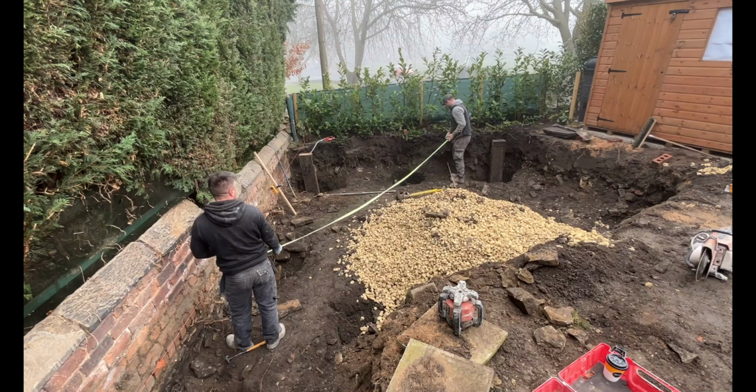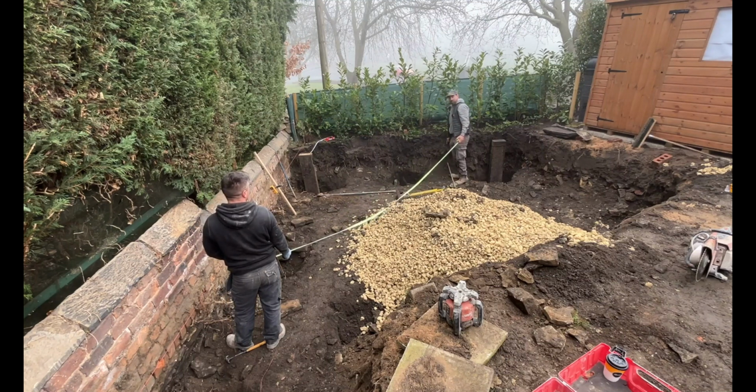Basically, kids, where the lines intersect, where the 5 meets the 3, that means that that then is square. Is it not? Perfect, that's right. 90 degrees. That'll do. So if I just finger it here.